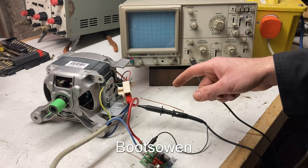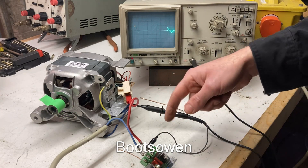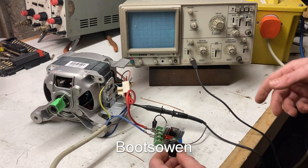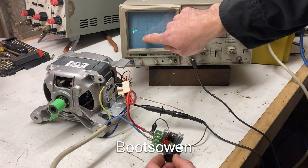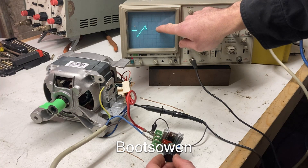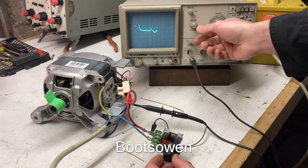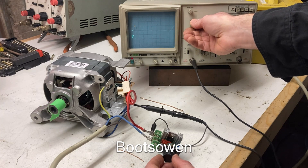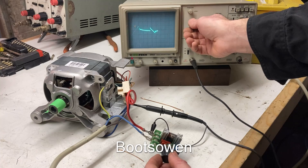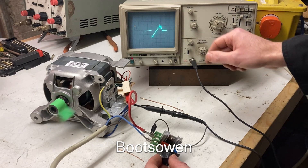I think I've got it set up a bit better this time. I've got the probe on the live and the earth or ground clamp on the neutral as it comes out of the voltage regulator here — without electrocuting myself, I'll try and manage this. So the voltage is rising here on a sine wave, it's chopped down to horizontal, and it jumps up again and drops down, and it's chopped up and then horizontal again. The position holding isn't great on this oscilloscope, but let's bring it up and you can see this line rising — and the flat line getting shorter.